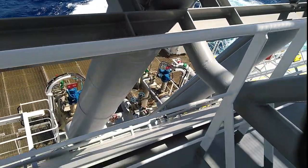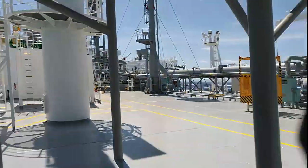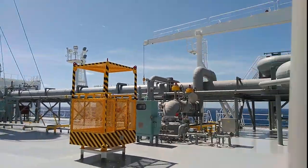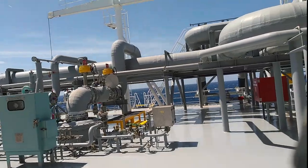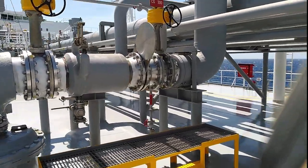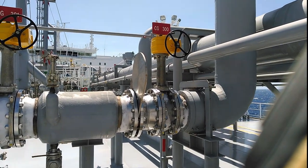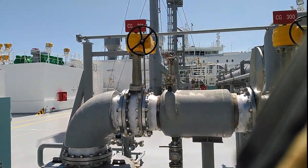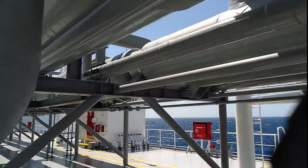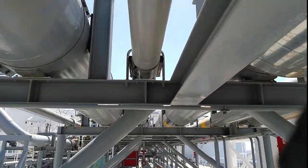Checking for any possible leakage on the double shut valves, I've pointed out with arrows what is what. Looking down at the liquid manifolds of tanks one, two, three, and four — they remain as they are. That cage is dedicated for personnel transfer. This is cargo tank number three vapor dome — it's protected with a water spray system located aft, and it has two isolation valves which we always keep open.